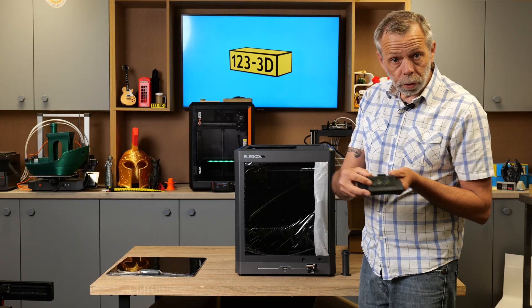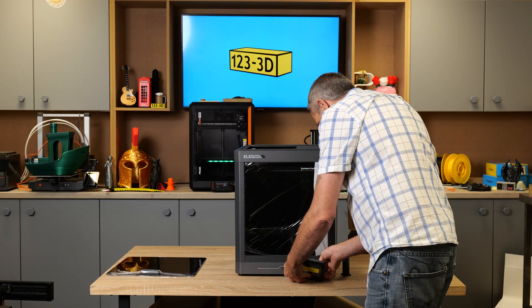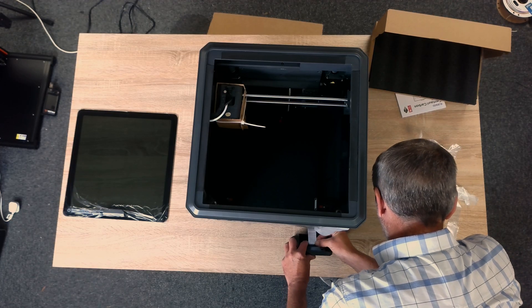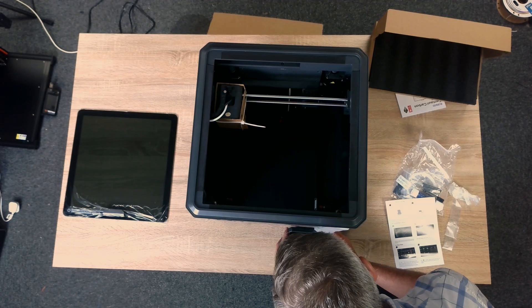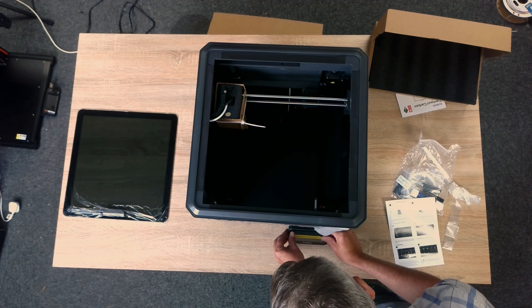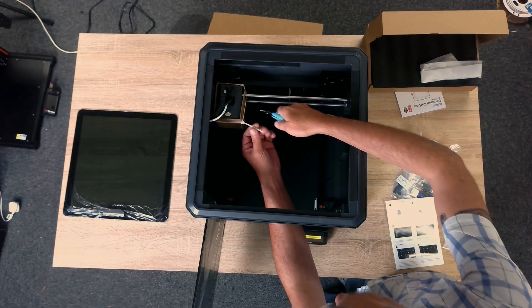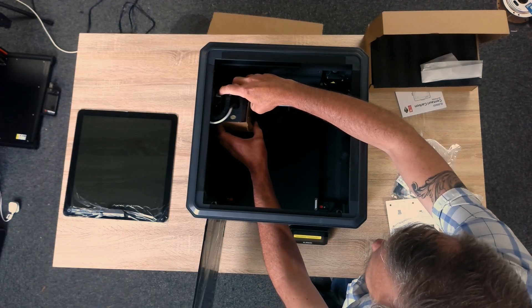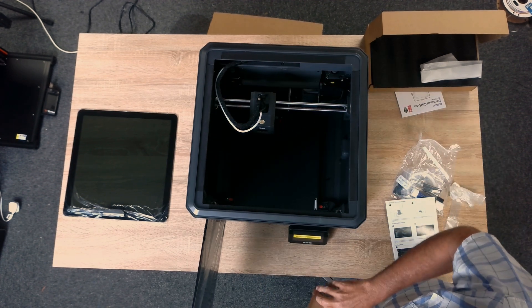On the bottom of the screen are instructions on how to fit the screen. Carefully take the ribbon cable, which is very awkward because it's set in a recess, so you can't really see what you're doing. There we go - we have popped that in. Just guide the cable back into the cutout, locate the lugs, slide it down. On the extruder, there's an oversized cable tie holding a bit of cardboard in place, so we shall remove that and remove the foam.